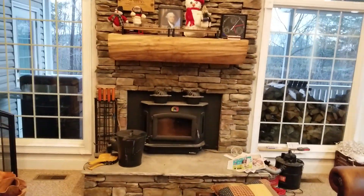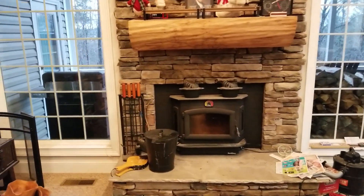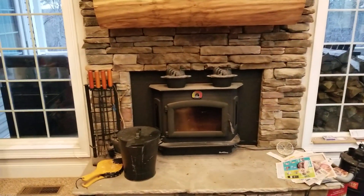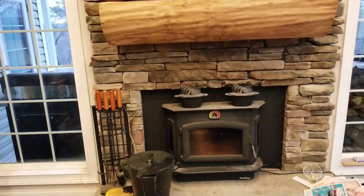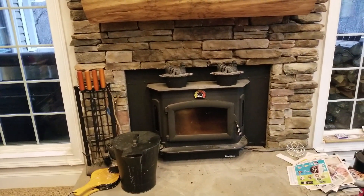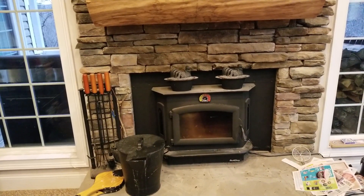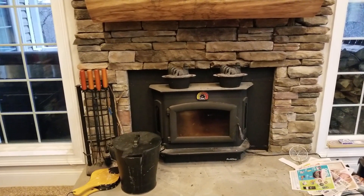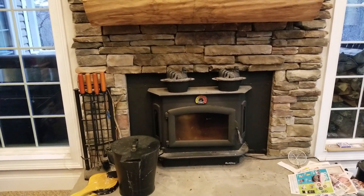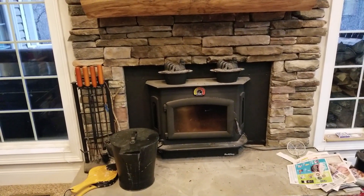You can see it goes all the way up with nice rock on the front — it was a huge fireplace. But when we ran it, it really did not provide any heat because it went straight up the chimney. I researched and found that because this is a bolt-on fireplace on the outside of the house, you had to get a non-catalytic stove. This is a Buck 81 stove — Buck model number 81 — and it's got a blower in it, meant for fairly large houses.